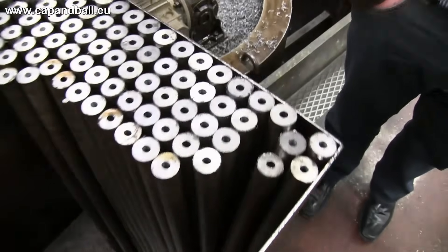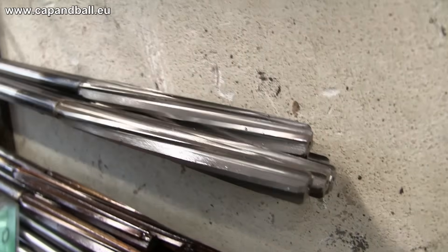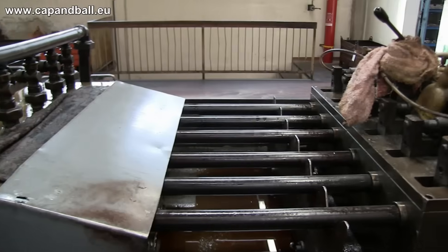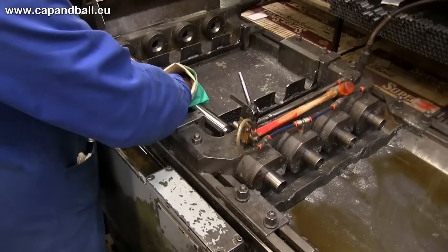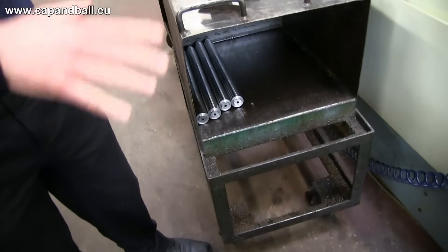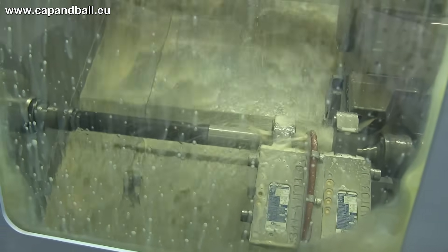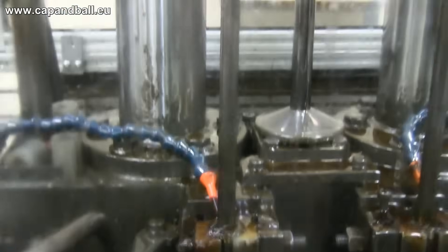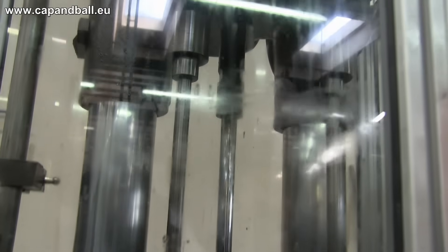The size of the drilled hole is always bigger than the groove-to-groove diameter of the future bore. The next step uses reamers to bring the holes to the exact desired diameter. This removes small inaccuracies from the drilling process and prepares the hole for honing and polishing. Reaming is also done on machines designed for 4 or more barrels at a time. The next station is a CNC-controlled turning machine that prepares the future barrel breech for the hammer-forging machine. Then the barrel is honed mirror-bright on both the outside and inside, as a very fine surface in the grooves and lands is a key factor in accuracy.